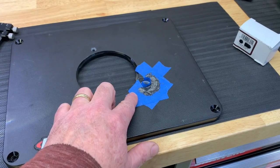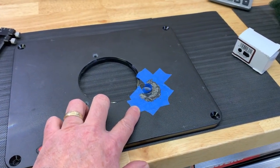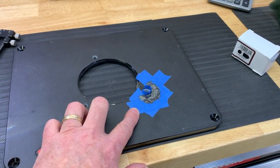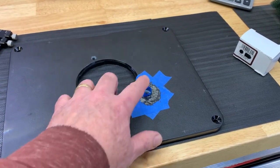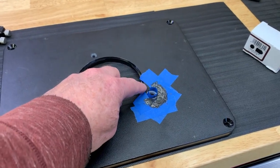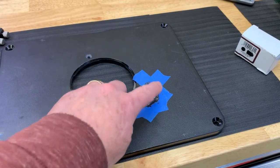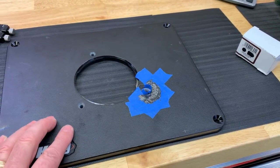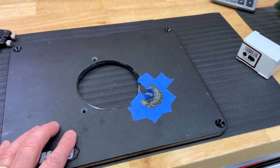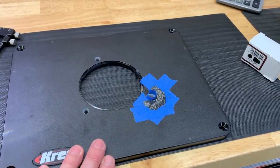Here's the plate with all the holes drilled and the access hole for the crank handle. I ended up using some epoxy to repair the tear-out — it was pretty bad so I didn't think I could clean it up with just a countersink cut. I had a couple of big chips, so I used some super glue to glue them back in, and then did an epoxy fill on the other side. When that sets up, I'm going to countersink it and hopefully it'll clean up nicely.